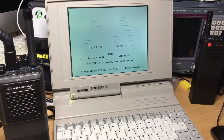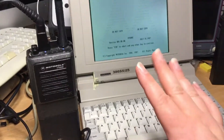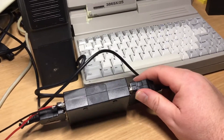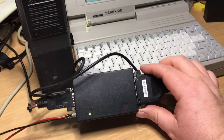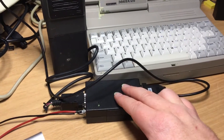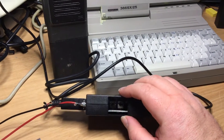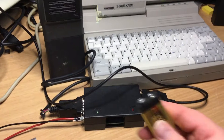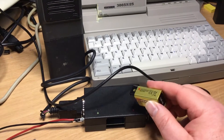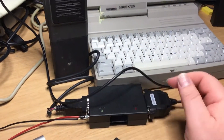I'm running the HT600E software in DOS as it should be on an old computer — there's a reason for that which I'll go into in a moment. But first, before we go into the software side, a matter that a lot of people come across is difficulties programming these radios: getting the radio interface box to work. There are a lot of these floating around from China. The 9-volt PP3 battery that goes in here doesn't seem to pack enough punch, even a new one, to get the charge pump circuit inside — used for level changing — to operate properly whilst dealing with serial data.